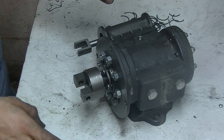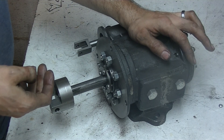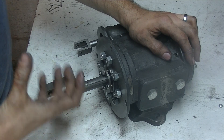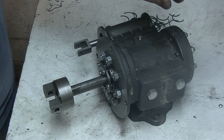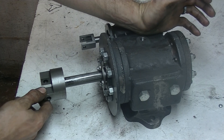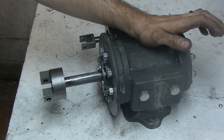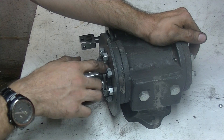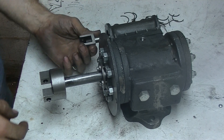The whole system works — but you may have noticed the up stroke is a little weaker than the down stroke. That's because the piston rod diameter decreases the effective area of the piston, since force is proportional to the area exposed to steam. With a piston rod in the middle, you're effectively subtracting area. I could have made it maybe 5/8 inch instead of 3/4 inch — it's a squared relationship, so going from 3/4 to 5/8 would give a decent amount more power. These are lessons for steam engine version 2, coming out in 10 to 20 years.